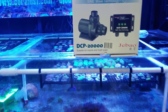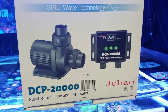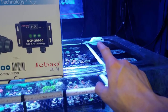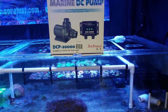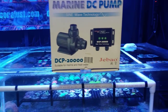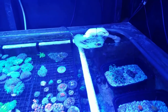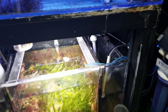That's just my quick review — I've been happy with this pump so far, it is pretty massive. I do need to get a backflow check. I drilled a hole in there for now because if that pump shuts off — I do have a backup generator which will kick the power on — but if the pump didn't kick back on, the water would siphon. I drilled a hole to prevent the siphon, but it's just creating air bubbles and it's not as good as I thought. I'm going to put in a flapper to stop backflow.